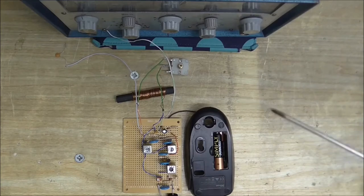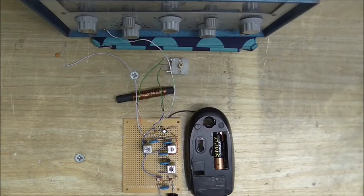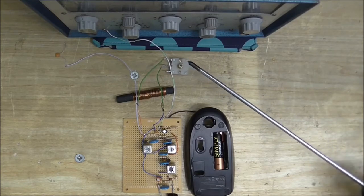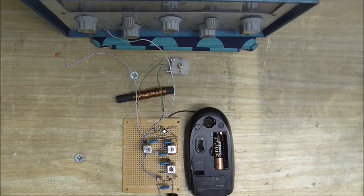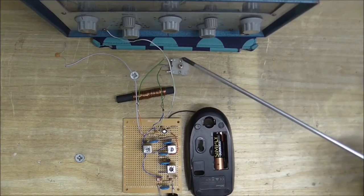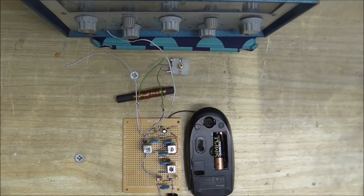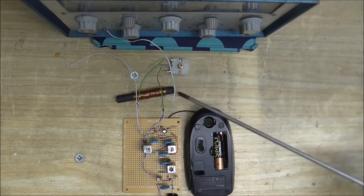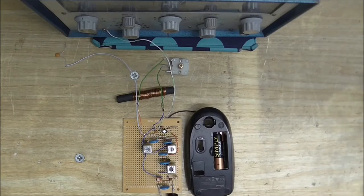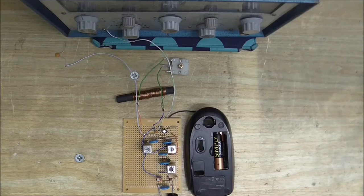What I've got here is a coil of wire wrapped around a ferrite bar, and this is what pulls in the radio stations, and it's tuned by this variable capacitor here. Now, usually in a Superhet radio you'll have two coils. There'll be one that's connected to the variable capacitor, which tunes the thing, and then there's another coil which actually picks up the radio stations, and that goes into the rest of the circuit. But here I've simplified things and combined all that onto one coil just to keep things simple. Also, if you have a really posh radio, like one that can pick up shortwave, you'll have additional sets of coils for those frequencies, but we won't go into that right now.